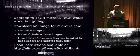So in terms of the device, it comes with a micro SD card that has Angstrom on it. I like to upgrade those to either 8 gigabytes or 16 gigabytes. You could go larger, I suppose. You need at least 8 gigabytes because my file image is over 6 gigabytes.